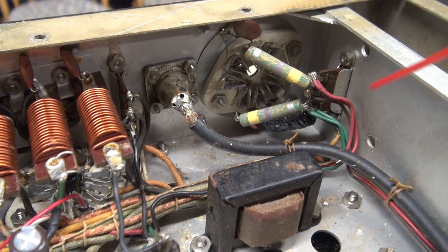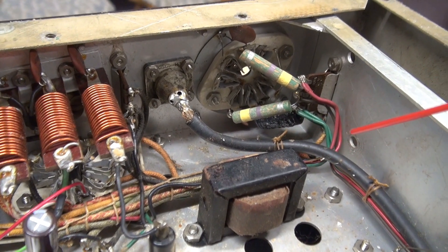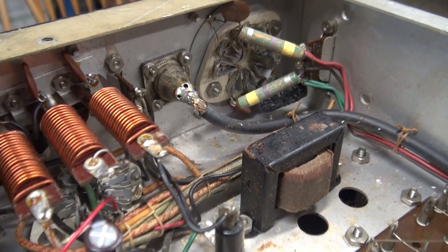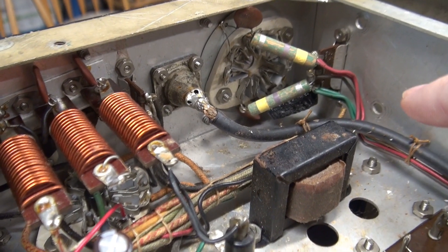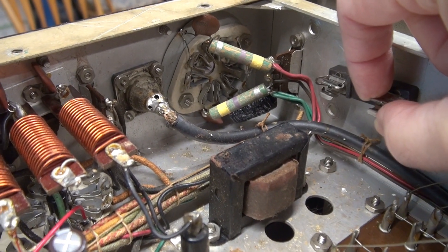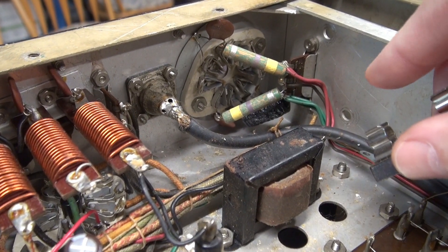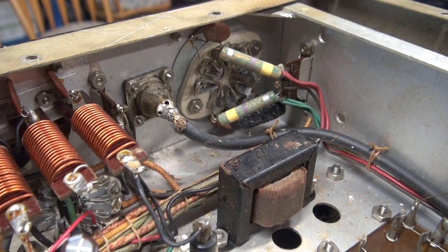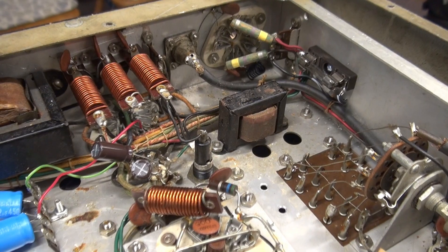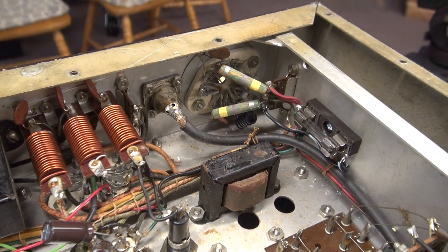Unfortunately, this wiring is not fuse protected. So if you develop a filament short anywhere on the Viking 2, its only choice is to melt the wiring. Since I normally see this fault where the wiring exits the radio for the VFO, my fix is to install a fuse holder to the chassis, pull that green wiring through the fuse — fused at 1 amp — and then go back to that terminal. Then if somebody hooks up an incorrect or shorted item, it'll just pop the fuse. I've got the fuse installed, which protects the rear VFO outlet 6-volt AC line.